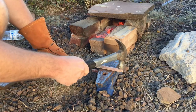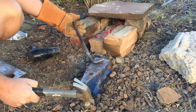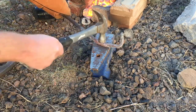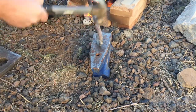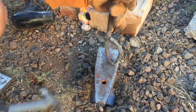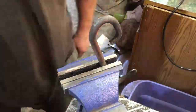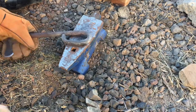For this part I do have to use the anvil, because I need to be up off the ground a little bit to get the 90-degree bend I need at the very end of the handguard. After putting that bend in, it's time to bend the whole thing back around so that the handguard forms back and meets the shaft of the hatchet. This part's a little tricky — if you wind up getting it too large, it doesn't provide a good secure grip, but if you get it too small, you won't be able to fit your hand in there. I realized that the end piece I had forged in was just a little bit too long, so I couldn't bring the handguard all the way back to meet the shaft. So I cut that part off and spent a little more time with the hammer reforging and reshaping. Sometimes when you get part of the geometry wrong at the beginning, it winds up creating a hassle later.